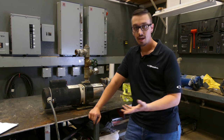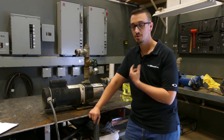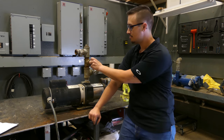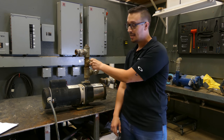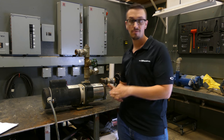The customer brought it back today wanting to know what's going on. I suspect we've got some impeller wear which has cut down on the pump's ability to do suction. We've also got a gate valve here that only turns about an eighth of a turn. So we're going to start disassembling this thing and see what we can find that looks wrong.